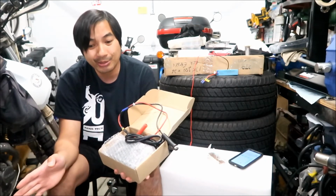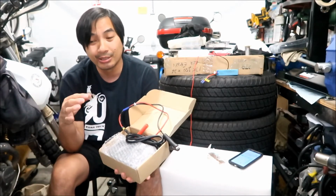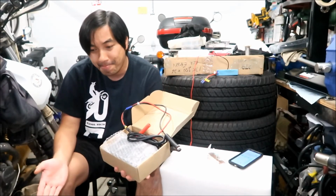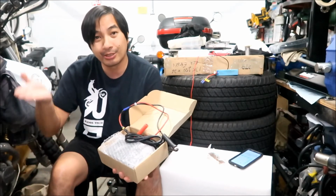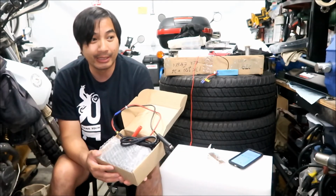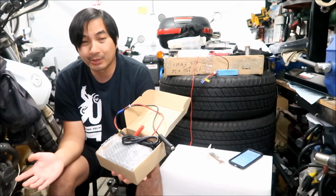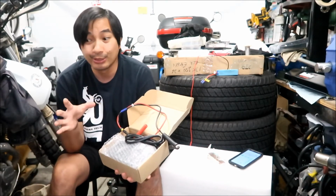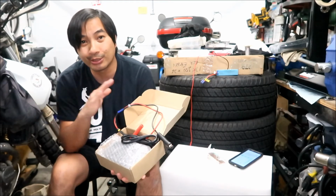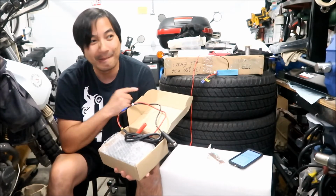I'll charge it up to 27 volts, and then check the voltages. If it's not balanced, I'm just going to charge the lower batteries up to match the other batteries. So we're going to do a top balance basically, and then fully charge it. That's why we want the BMS: if there's a cell imbalance, it'll catch that and cut the power going to the battery. It'll try to protect the battery, and that's the reason you want the BMS.